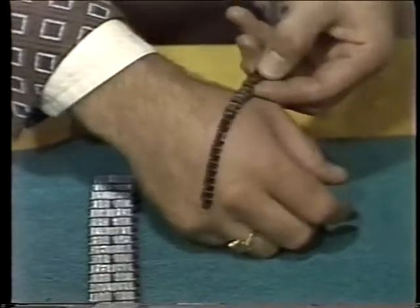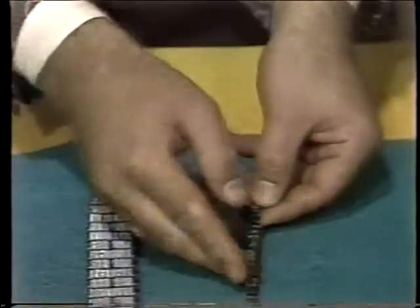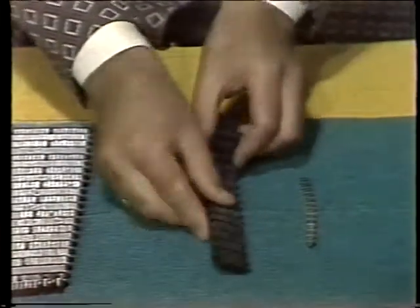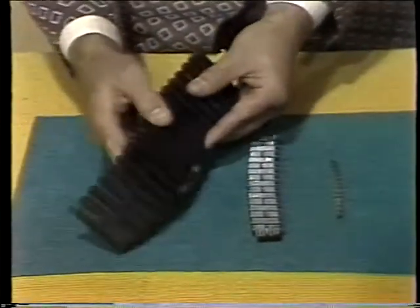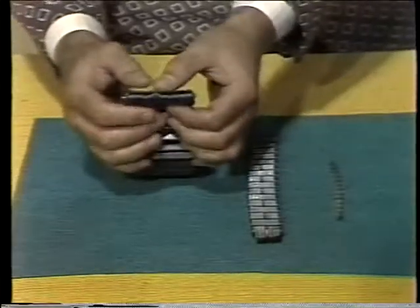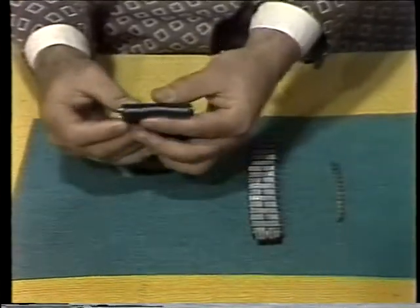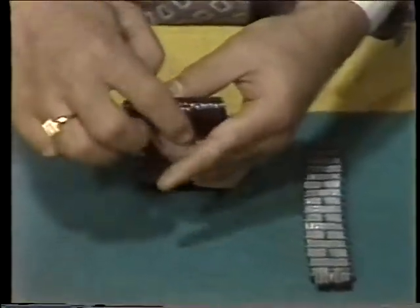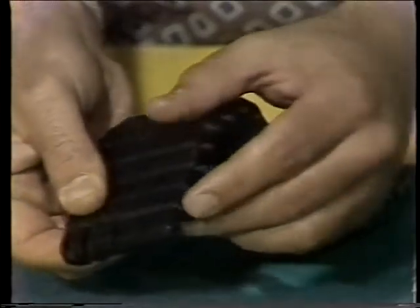Now this is a piece of silent chain. And here's another piece of silent chain in a larger section. There's no limit as to how wide silent chain can be made since it's composed of a series of side plates held together by pins. The term silent chain is somewhat of a misnomer — it's not completely silent, but as compared to roller chain, it is much quieter.